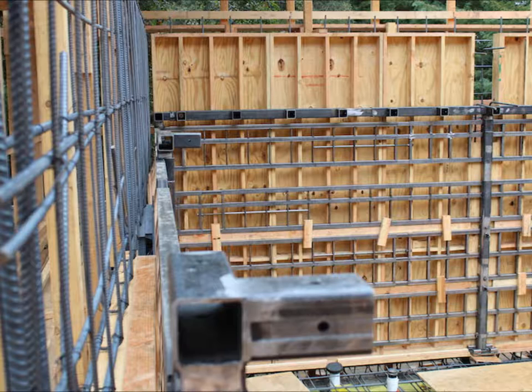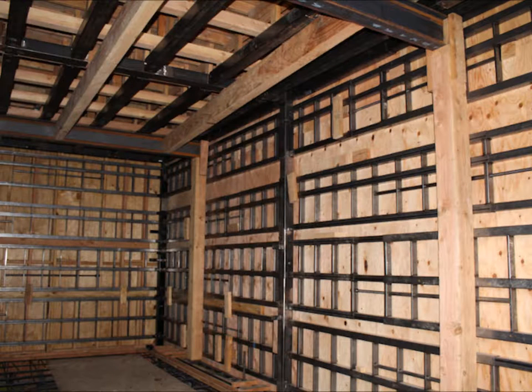The interfacing is installed in conjunction with the inner frame structure and marks the completion of the lower walls. The ceiling formwork defines a junction between the wall and the roof and is installed above the inner frame structure. During the design phase, we can choose to prefabricate the interfacing and leave it with the casting to become the non-structural wood interior. So when we remove the forms, we already have an interior wall structure with rough electrical and plumbing in place ready to receive insulation and drywall. This shaves significant time off the project schedule.